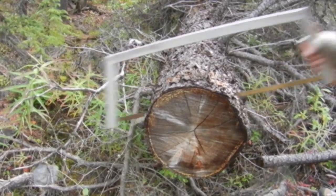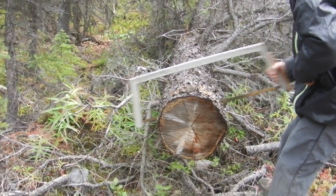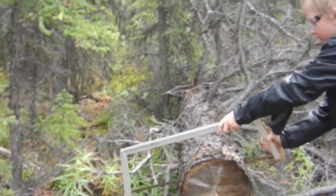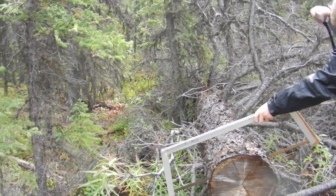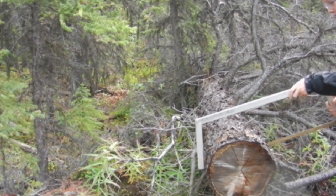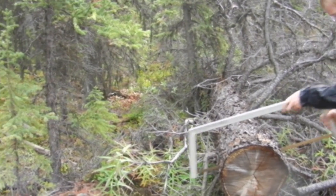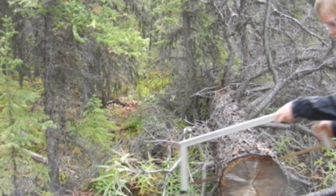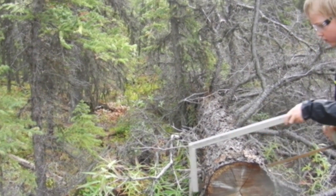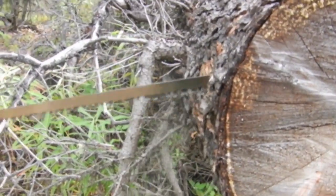They're also light and take a little less effort. Use whole long strokes — you should be able to hear the saw sing a little song: Z, Z, Z, Z in a nice rhythm. Use the full length of the cutting surface. The biggest mistake is people making short little movements. Look at the dust pouring over there.